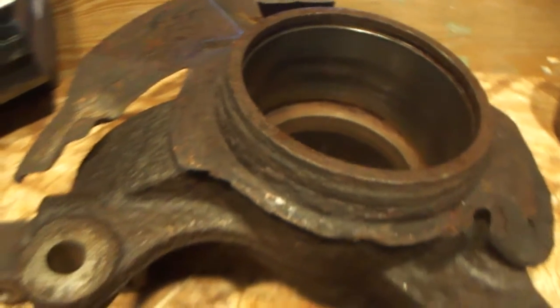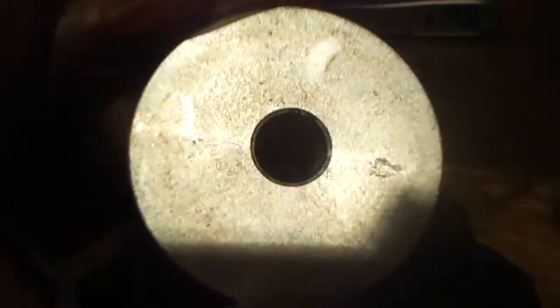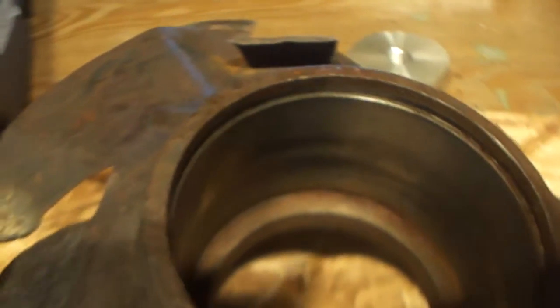Initially I tried the conventional methods — basically using plates on top of the old bearing and using a BFH. This thing was not budging. I used heat and cold, boiling water, put it in the freezer — that wasn't working. Plan B was pretty much cutting out the whole inside of the race. I cut out all the inside of the races and used a piece of eighth-inch steel, battering on it with a long pipe — still nothing.